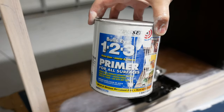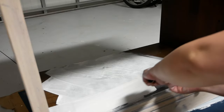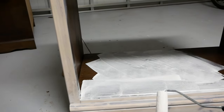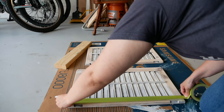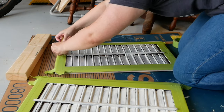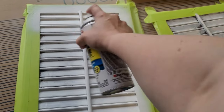For the inside of the cabinet, I wanted to paint it, but first I'm going to prime the surface. Pine is notoriously bad for wood bleeds, where wood oils or tannins leach through paint — usually it happens not when you're painting but when you apply the finish, and then it looks really bad. So I pulled out my roller and applied primer. Tin foil in the tray is life-changing, so use some tin foil. I made an attempt to apply primer to the slats using the foam roller, but that didn't work well, so I ended up busting out the tape and taped down all the outside perimeter of the slats. I then used an aerosol primer to further coat the slats with a healthy dose of primer — with all the different details, aerosol made sense.